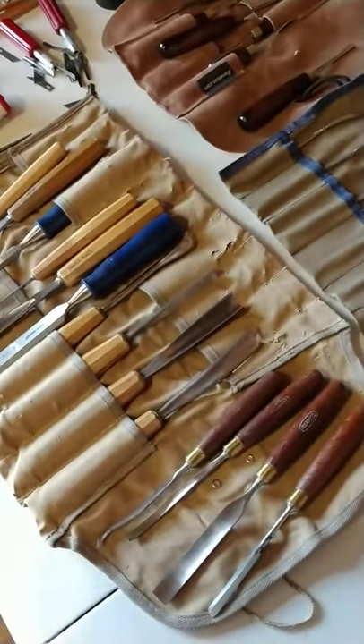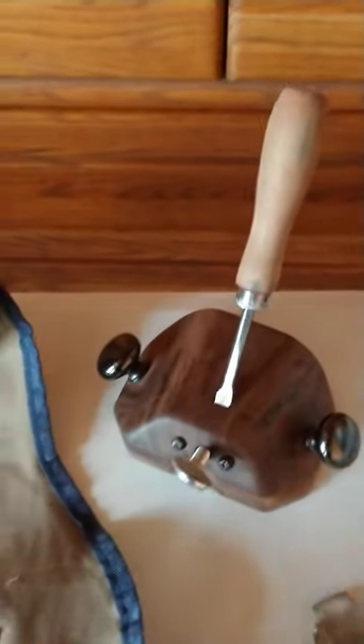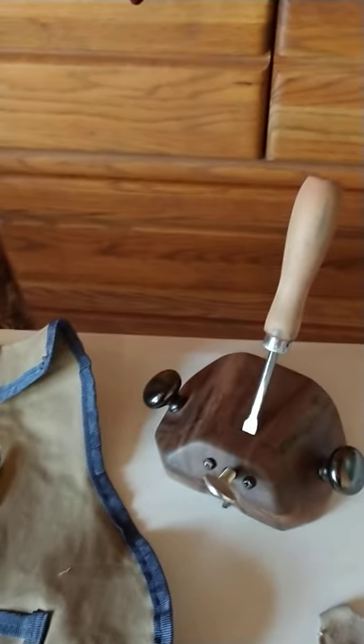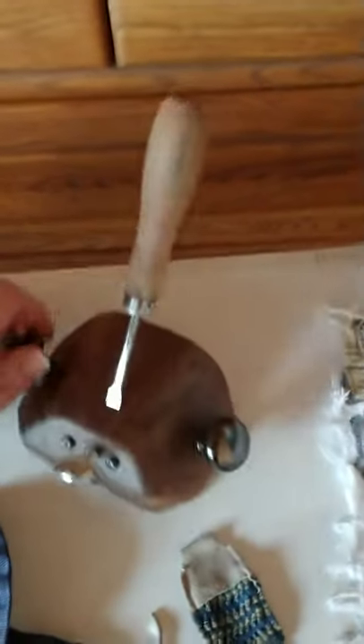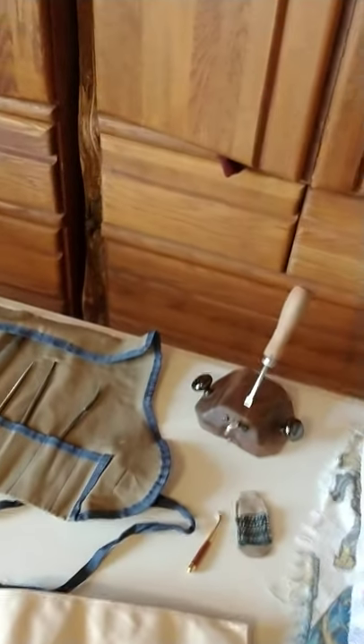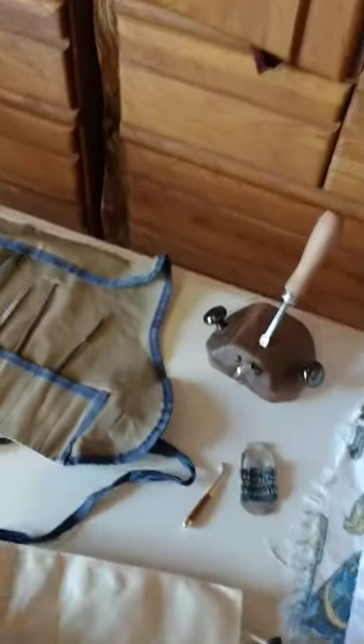There's a woodcarver who's got a shop up in St. Louis Park, Minnesota, and he's got a lot of these, but I don't think he sells them. Here's a router plane that I made myself. This is just some old chisel that somebody made out of a file — you can see the file marks in it still. I got that at an antique shop for a couple of dollars and I made my own router plane. It works great. It's one of the few homemade tools I made that actually works. I don't use it a lot, but when I do, it works great.